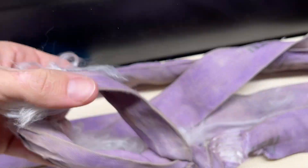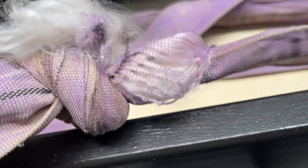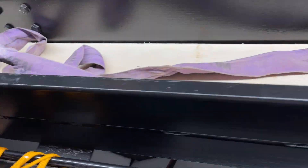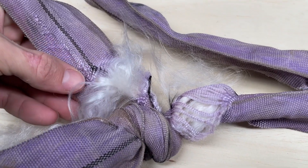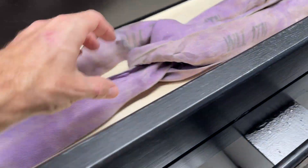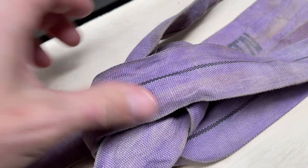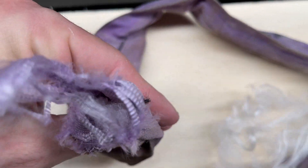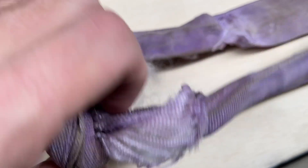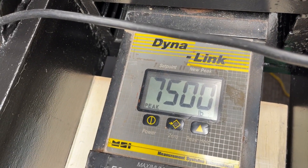So that's our original damaged spot — it is a really cinched up knot. Interesting what it did to the outer sheath and probably some of the fibers inside. If I'm not mistaken, it broke on this side of the knot — the knot was worse for it than this basket. It looks like this basket held up fine; I don't see any damage on it. Definitely don't want to do overhand knots in your slings to shorten them — you want to do something like that basket method instead. There's only sheath here, the fibers are up inside there, and our number was 7,500 pounds of force.